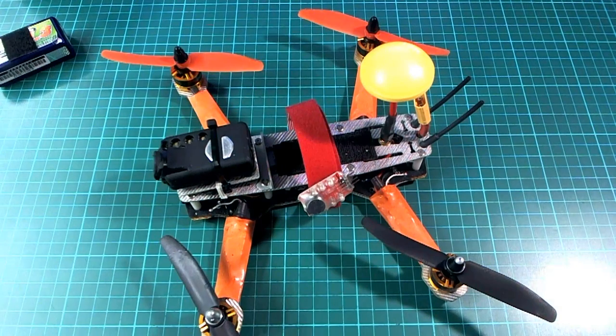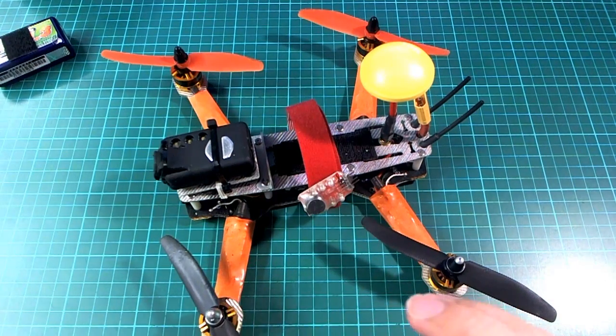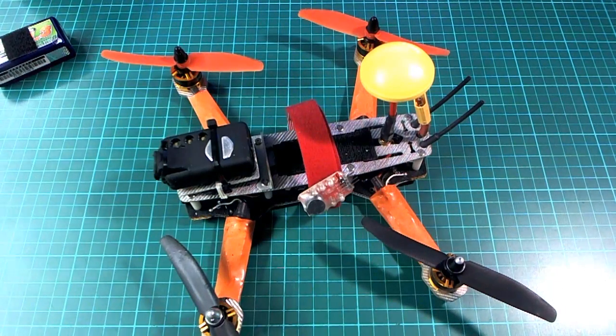I did a bit of testing and found that with CleanFlight 1.9 and CleanFlight 1.10 everything was fine. Then when I get to CleanFlight 1.11, things start to go very wrong and the problems I just mentioned occur. I also tried Betaflight, and the same problems seen in CleanFlight 1.11 also occur, except they're not quite as bad — the oscillations don't grow so quickly and in rate mode it feels a little bit more locked in.